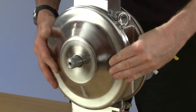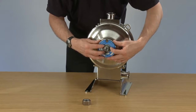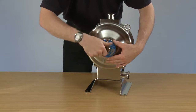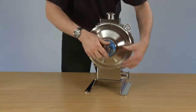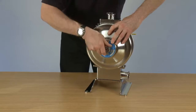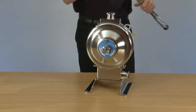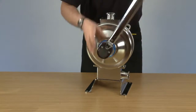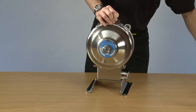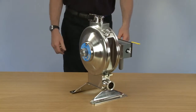Replace the secondary dome, then the dome washer, rod washer, and main nut. Then re-torque the pump. And that's the diaphragm change completed on a Flotronic one nut pump.